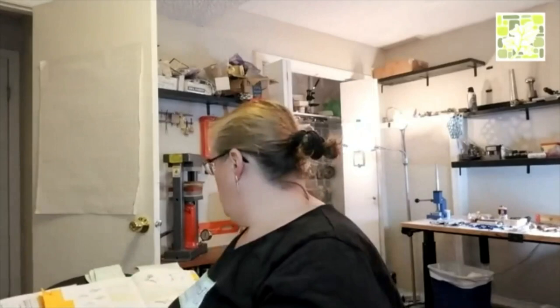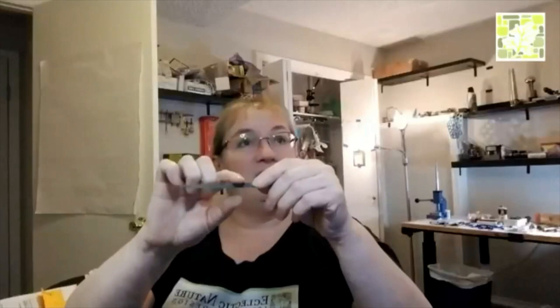And also on page 57, note that if you are going to use the barrette file for doing your finishing, he encourages us to sand down the edges of the barrette. So I tend to sand down, excuse me, I've got the hiccups, I tend to sand down my needle files right away. You just want the edge that it comes with naturally, which may be a little rough, to be blunted down and smooth, because otherwise it's scraping up against things.